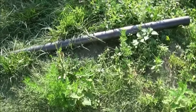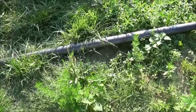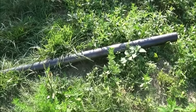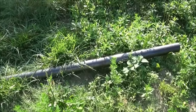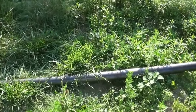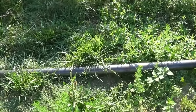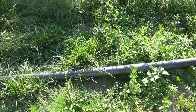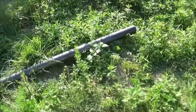And now when I get it sunk in the ground and get it concreted in and it's set up, I'm going to put that mount that I showed you over there on top of it and bolt it down. And I got a 100-watt panel I'm going to put up there just temporarily to get it going, so that I can adjust everything with the actuator and with the tracker to make sure it's tracking where I need it to track and the limits are set and all that stuff. And I'll show you guys when I actually get that put up there.